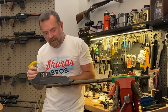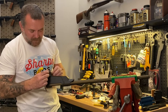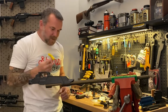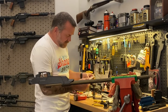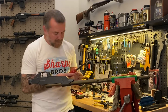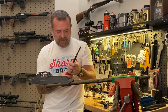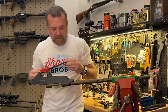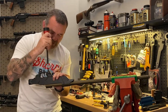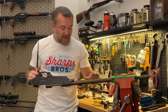Just get that going and get the first one snug — I didn't really put any torque on it. Now the second action screw is right behind our magazine lever. With the Savage 110 we were able to design it so you can just press that mag lever forward and drop the screw in behind and get your hex wrench in behind. Again we're just going to get that snug to start. Then we're going to get out our torque wrench. Also in the bag of parts is a little extended hex wrench so that if you need it for use with your own torque wrench you can just attach that in. This is me torquing this wrench up to 55 pounds. Hit the front screw first until that pops over, then push the magazine lever forward and get down in behind there. 55 pounds should be enough. Now you've got the chassis body securely attached to the barreled action.